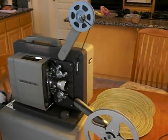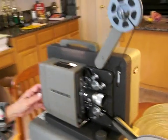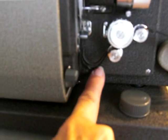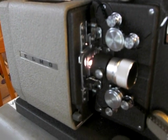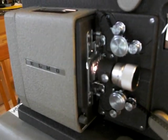So now everything is working. We're projecting to a little box here with a piece of paper on it — that's our setup. You can notice there's no clicking noise and the film is not jumping around; it's nice and smooth, with a nice loop at the top and the bottom. If you get any kind of clicking noise, stop the motor and recheck that the film is straight, especially through this rail here — that's where it will jump around on you sometimes.